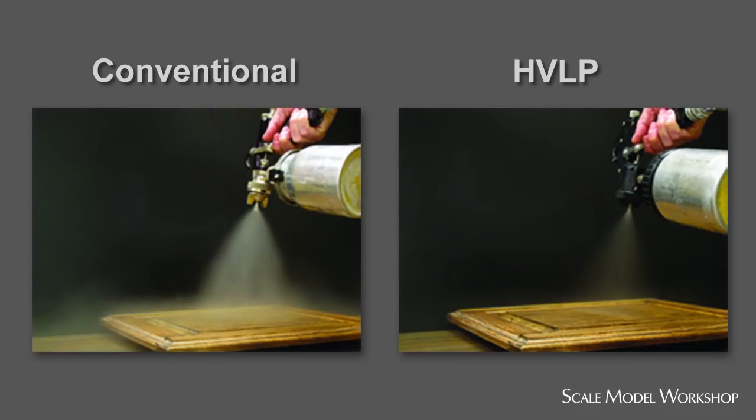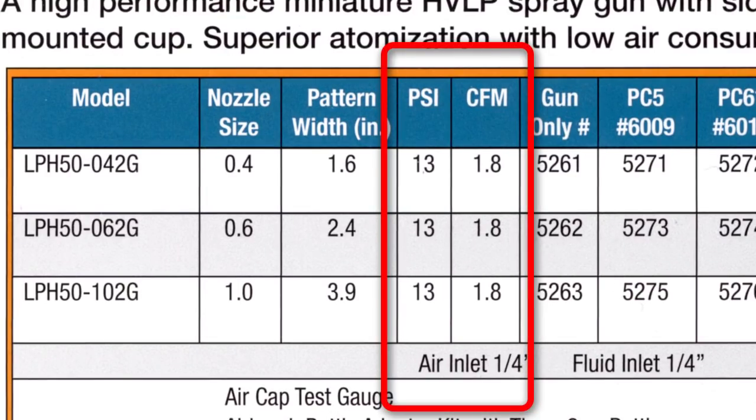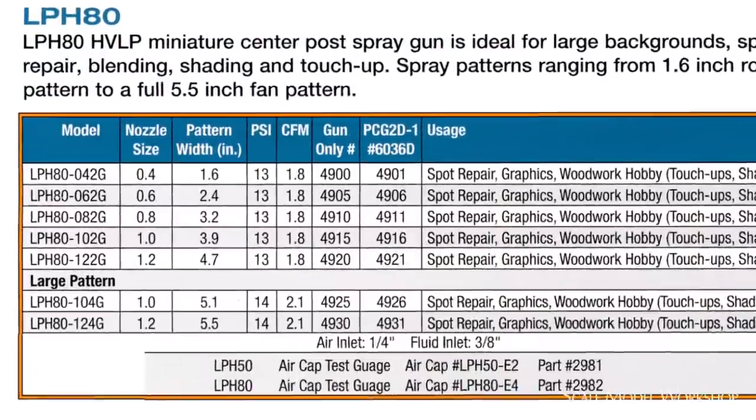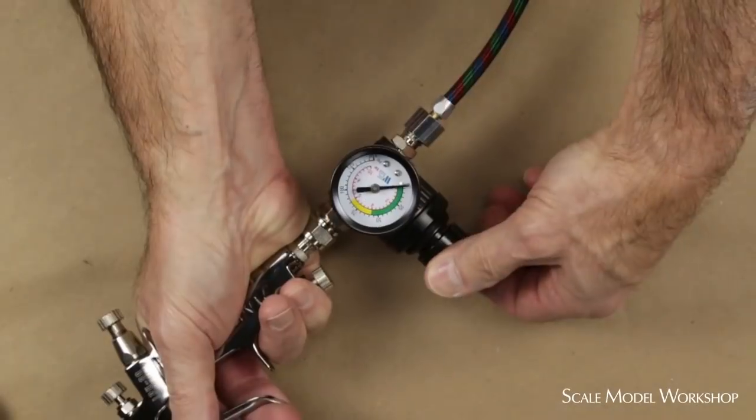of overspray and fog. Setting up and using an HVLP gun is a bit more involved, and it requires a compressor that can supply a continuous flow of larger volumes of air. This is why I wouldn't recommend them to a novice.